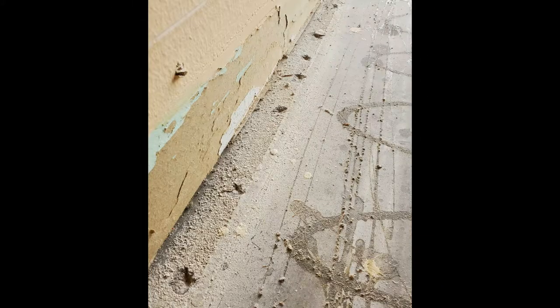And wherever there was carpet tack strips along the edges, when those nails are put into the concrete and they come out, they usually leave a little divot. And so we will be repairing that. I'll be grinding the surface to get it all nice and flat. And then we'll be applying a concrete overlay or a microtopping. And I'll explain more about that when we get there.